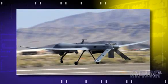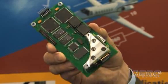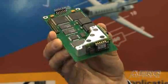Now, how is this technology derived? Obviously a gyro can be fooled to a certain extent, but I would assume under these circumstances that this system's information literally cannot be fooled. You can still fool a system — it's very difficult to do. Predominantly this came out of the automotive market, with some military applications as well. Every year we're seeing the technology get better and better, to the point where it's really surpassed traditional fiber optic gyros and is starting to approach the level of the military ring laser gyro. The way they work is very similar to a tuning fork principle. Once you vibrate it, it tends to go in one direction and wants to stay there. We can measure that deflection when you start rotating around a certain axis, and that's how we get the rotation and acceleration.